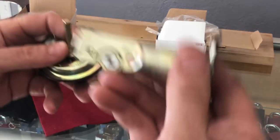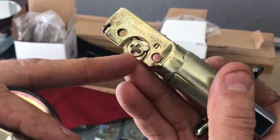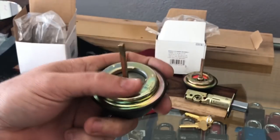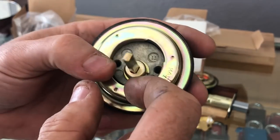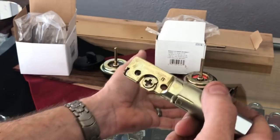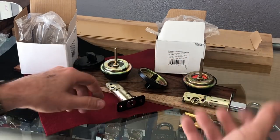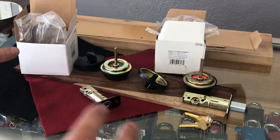What is a big deal is that Schlage has jumped on the bandwagon, and presumably after all the old stock is out, we won't have the cross-style latches anymore — they will shift strictly to this style of latch. That is good because, as when Defiant changed it and I gave them kudos, this would significantly reduce the twisting we saw previously. It's a thicker bar. However, the problem you're going to have is: say you get to a house with the old-style Defiant or Schlage Dexter deadbolt with the cross tailpiece — those latches are going to fade away and we're going to be stuck with cross-incompatible latches.